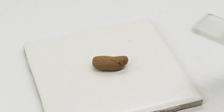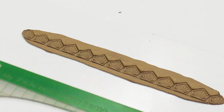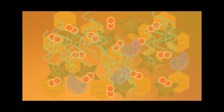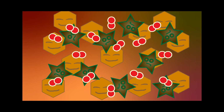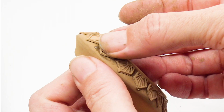This mixture is what makes the clay malleable, allowing us to roll out, texture, and cut different shapes and forms. The longer the wet clay is exposed to air and/or heat, it dries out. The water evaporates, leaving behind the binder and metal particles, and at this point, the clay becomes hard. That dried metal clay can then be sanded, altered, and combined with other clay pieces.